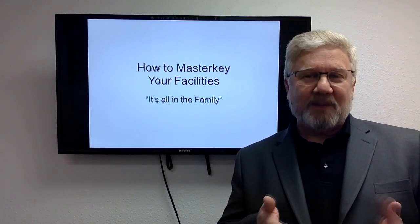She's married to her husband, the grandfather — which is the grandmaster key. That's a key that's going to basically be able to rule over the whole family, with some rare exceptions. The grandfather key, the grandmaster key, is the one you carry on your hip or keep in a safe place. That key is going to get into any core, any lock, that we put underneath the family tree system. It gets into padlocks, cabinet locks, door locks, electric switches — it is the key designed to have the power.